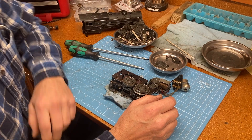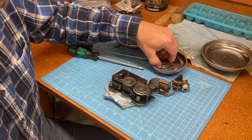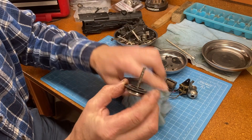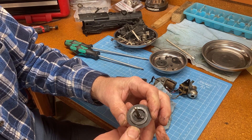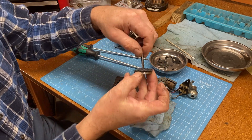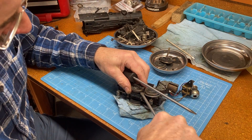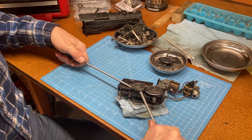I'm back. I've watched a YouTube video on how to remove these wheels, which means I'm now an expert. You can see I've got the first one off — they are pressed on. If you look closely, you can see there are splines on the axle, so it's a press fit. I can take a punch and punch this wheel off. I may actually leave it on — there's really no reason to take it off the axle. I can clean it like that. So I'm going to proceed and take the other wheels off. We can't get this motor out until we get at least one more wheel off, so I'm just using the two-screwdriver method. There is a way to do this with a wheel puller, but you need a special narrow wheel puller.